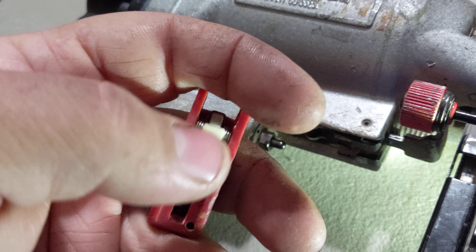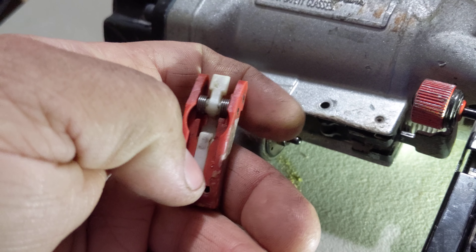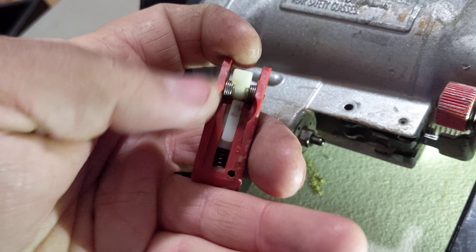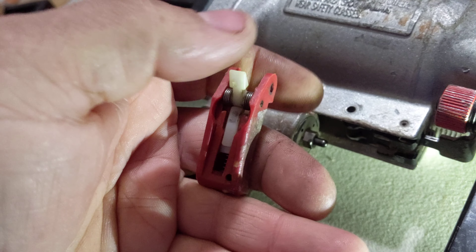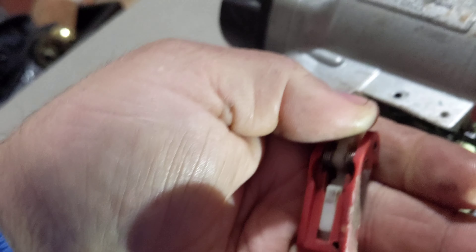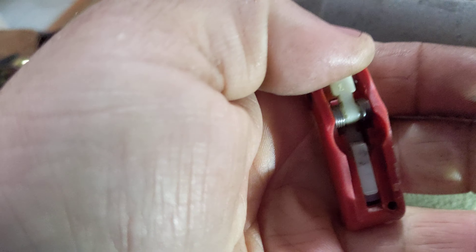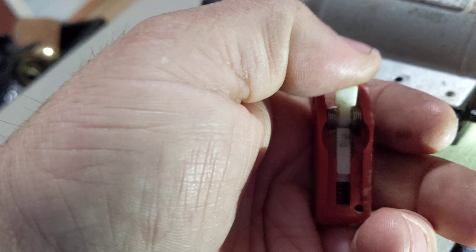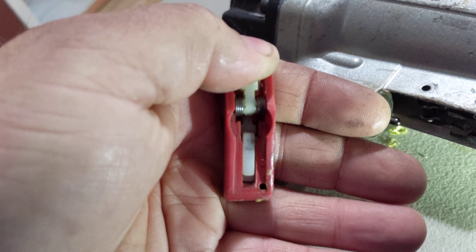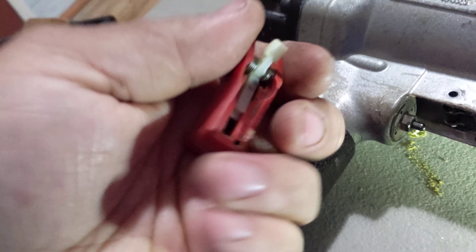What I'm seeing is when this lever is pushed that way, it lowers this block right here. And when it's pushed this way, it raises that block. I'm thinking it's probably supposed to be retained with a spring — it's probably broke. When the block is slid down and the trigger is pulled, the solenoid switch doesn't make contact because there's a void there. I'm thinking that's how it's supposed to work. I'm going to pull up parts diagrams online and verify.